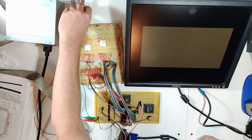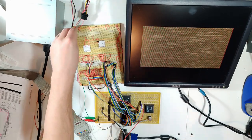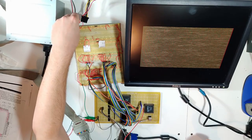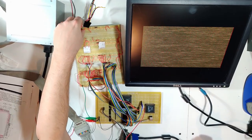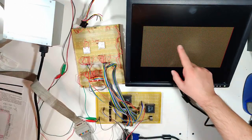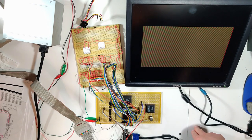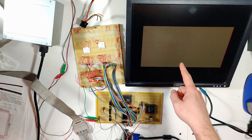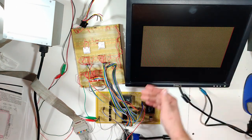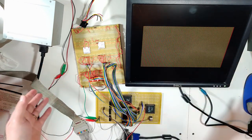This also might just be... Yep. Yeah, it's just a... This power supply has... It's just a bad connection, frankly. And I get bad grounding here, so let me try and screw around with that a little bit. Yeah, there's still some noise there, but pretty much all of that noise is due entirely to bad grounding. But still, that is promising. For fun, let me just do some more writing crap to memory because, like, I can. Then that's fun.